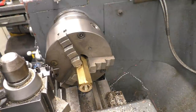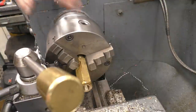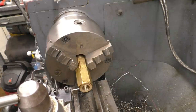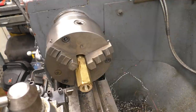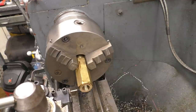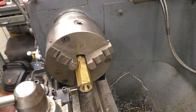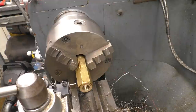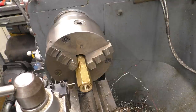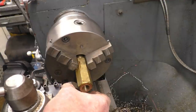First thing you do is make sure it's nice and square to the job. The tool post off and doing that with it. The blade's 2mm wide, we want the nuts to be 16.5. We'll touch that onto there. 2mm first, and that puts the blade right on the end, and then just 16. Right, and that's the first one. Looks good.